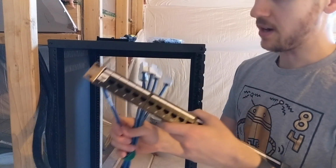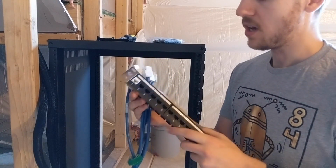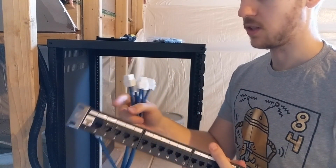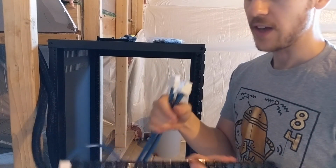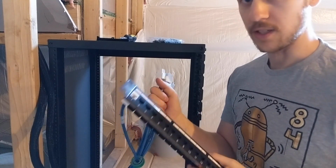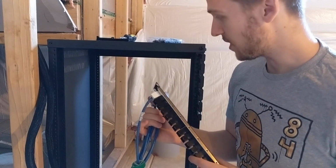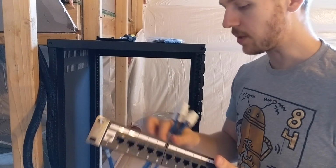And I guess the nice thing about it as well, although I'm replacing these because I have my own loom panels, I'm pulling out these keystones. It doesn't really matter, because if you look on the back of them, it's still just a standard RJ45 plug into the back of it. So whilst my loom from where the panel is going to replace these, if I run more cables and they're not loomed into keystones, they can just go into the back of the RJ45 connectors. So I really love the versatility of these patch panels versus me just punching the cables in, because once they're punched in, that thing's there forever. And as I said, this is going to move around potentially, so I need the flexibility to pull this stuff out if I need to. And then that's how I'm going to do it.